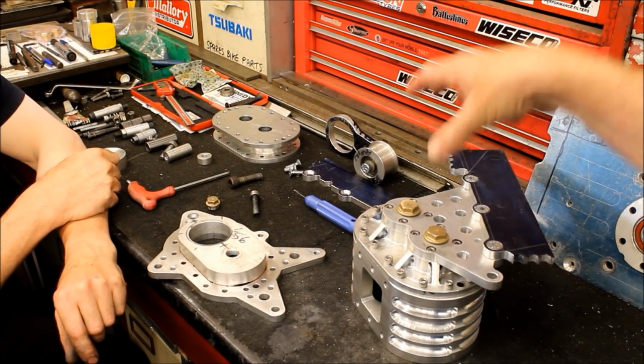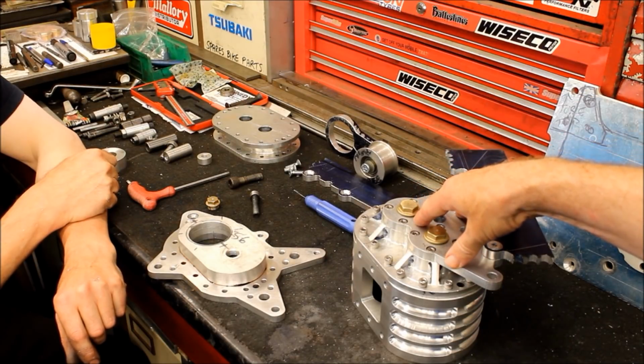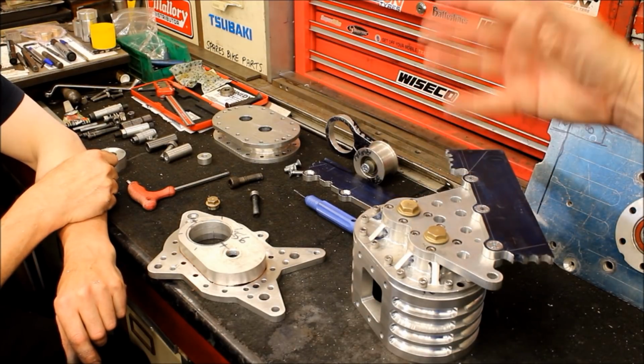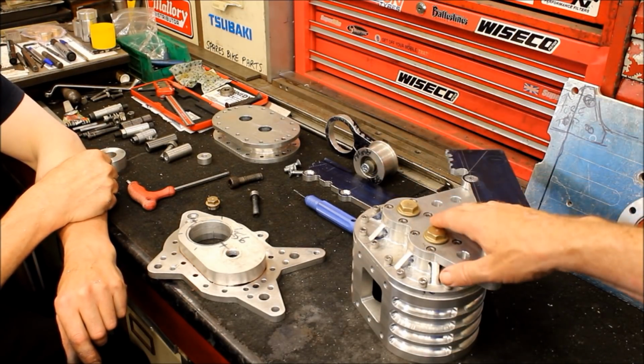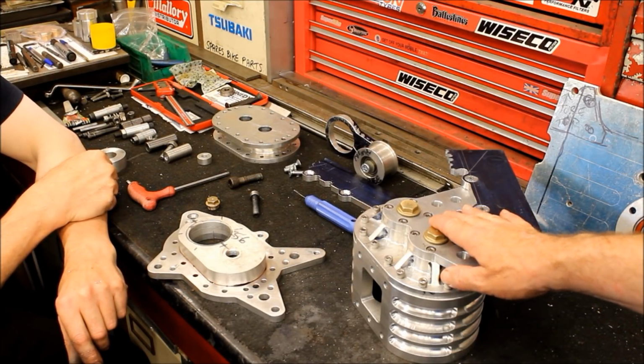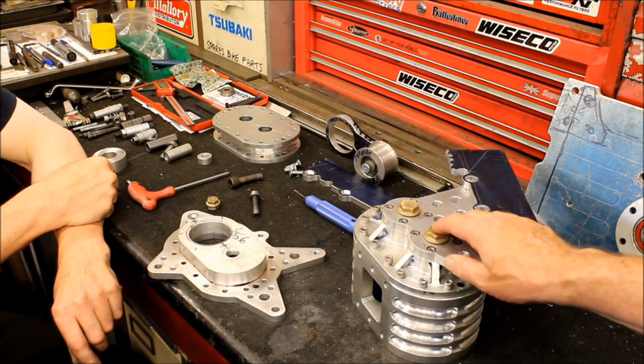And one more thing we should say is, of course, that you've decided you had to remake the whole back end of the frame, because the rear wheel's now lower down. That used to be the rear tyres. Usable, but then the engine was nearly 5.5 inches off the ground, which is too much, and it looks wrong.